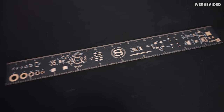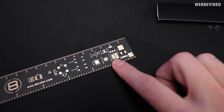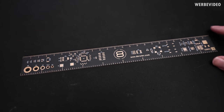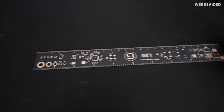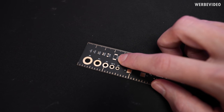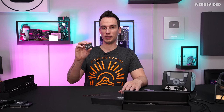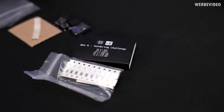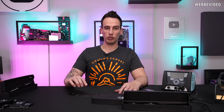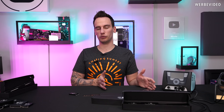Let's move over to the front side, which is certainly more interesting. The original idea was to just have some SMD footprints on here — like the stuff on the bottom right, which could be a power stage on your VGA — but then we also thought it would be much nicer to have something actually useful on the ruler. Starting on the top left we have different sized SMDs for resistors or capacitors, and then box number six is marked as a soldering challenge, which allows you to practice soldering SMD components if you've never done that before.